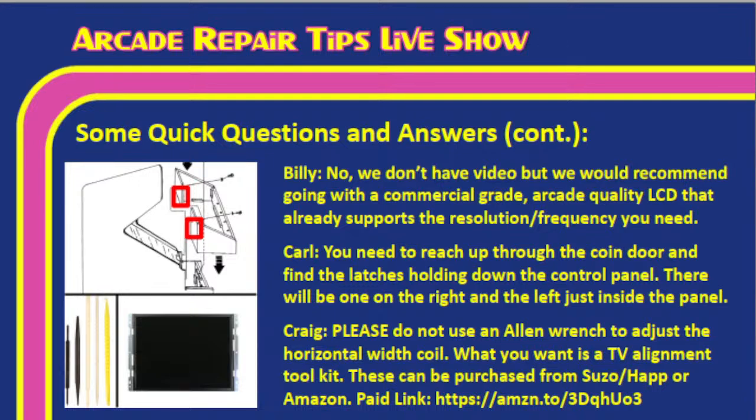So Billy, if you want to do an LCD in your game, commercial grade arcade quality LCD, you can get those from Suzo Hap, TwistedQuarter.com, Arcade Shop, who else? Holland Computers. Basically, any arcade parts supplier will have a commercial grade arcade quality LCD that does a whole bunch of things a whole lot better than off the shelf. One, it comes on when the game comes on. There's no rigging power buttons. Two, it already has the converter built into it, so you don't have to have a separate converter board. Already supports the resolution that you need. It's just a whole lot less of a headache, so please do that.